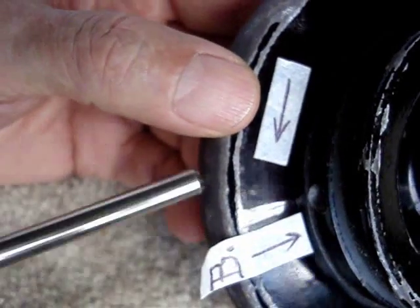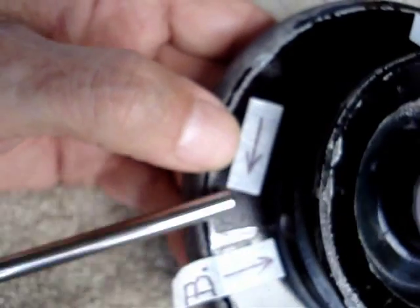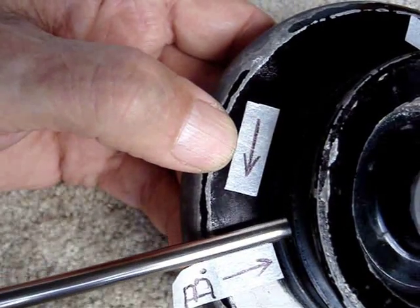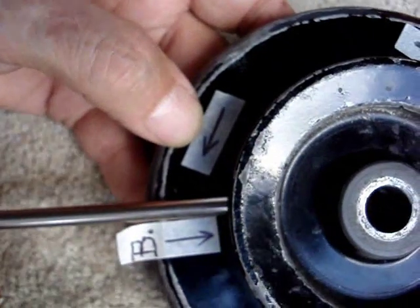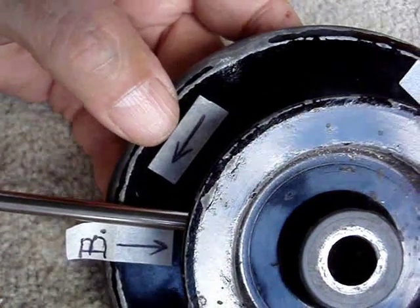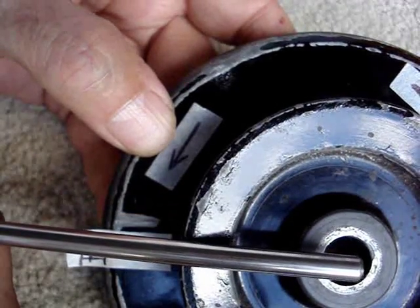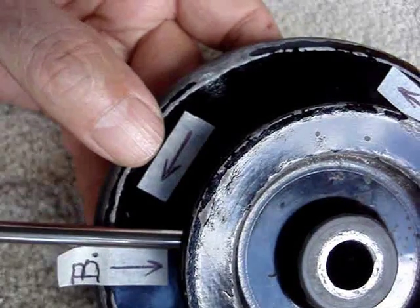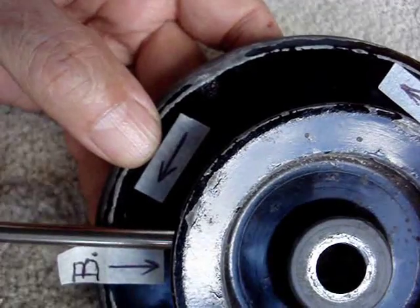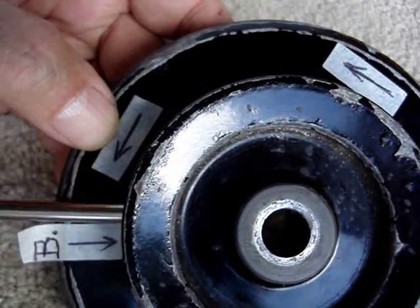This hole appears to be over a quarter of an inch, and this hole here looks more correct to me — although I have no way to judge since I've never had another one of these hand wheels in my hands. This is hole B and it's on a slight angle. You can tell it's not heading to the center — it's heading on an angle like this. So is there supposed to be two or three set screws, and are they supposed to go straight into the bore?